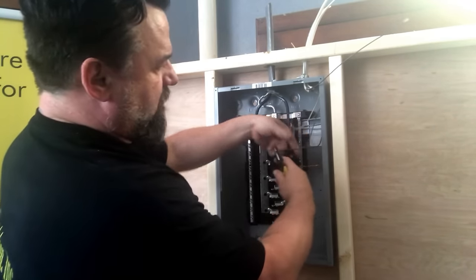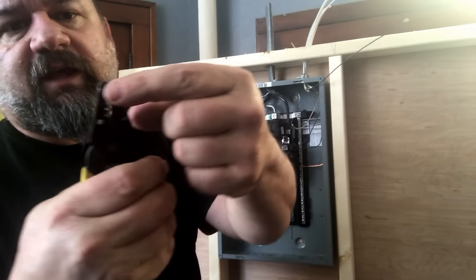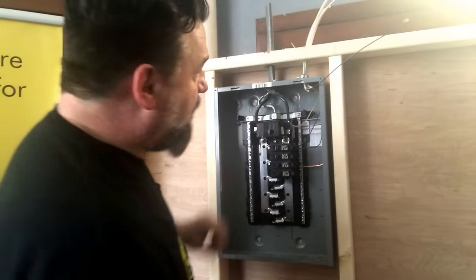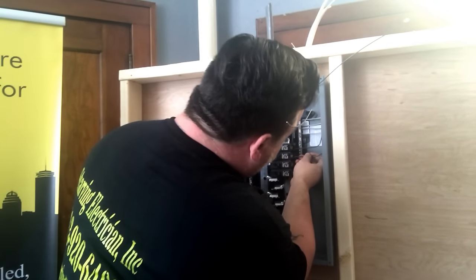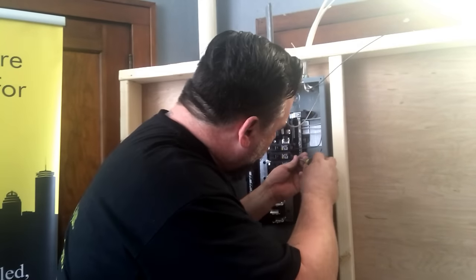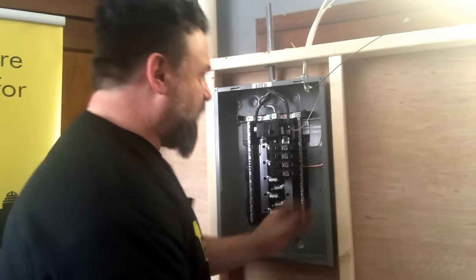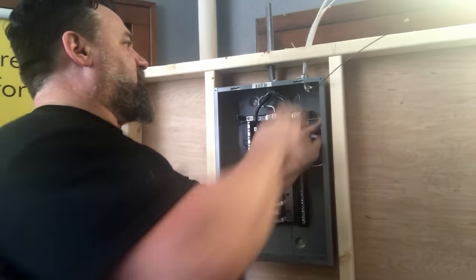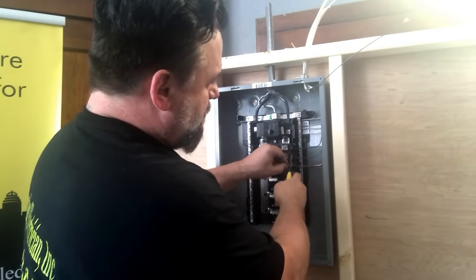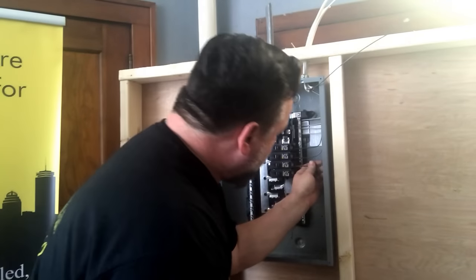Down the line, strip it out about half an inch. On your strippers, you've got your gauges where your number 14 is. Your white's the 14 again. We're going to get into that, for why it's 14, the amperage, the 15 amp breakers. We're going to get into a short version of why. I'm going to tell you what wire goes to what breaker. Simple as that. You don't need to ask any questions. You've got 15 amp wire, you better use a 15 amp breaker.